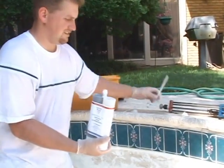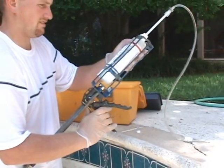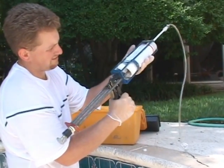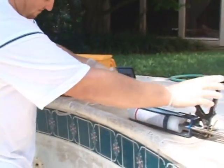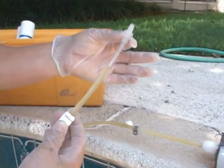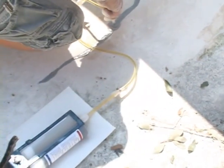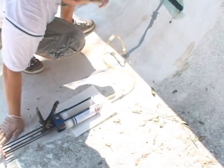Step 6: Attach a mixing tube and hose assembly to the Pool Bond urethane foam tube set. Insert the tube set into the two-part injection gun, otherwise known as a Jake gun. Squeeze the trigger until the urethane foam goes through the mixer and into the tube set. Pinch the hose using the white clamp on the hose assembly. Insert the hose assembly at the base port of the crack and begin injecting the crack by gently pulling the trigger. Monitor the flow of material by watching the tension bar located at the back and center of the Jake gun behind the spring.